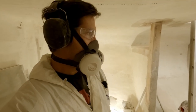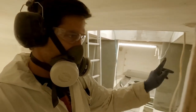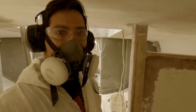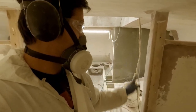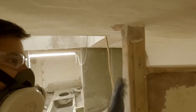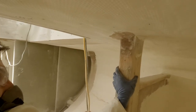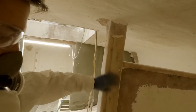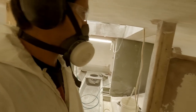But for the keen eye amongst you, you may have noticed that there are random spots where the gel coat has been knocked off. Well, I've been up top fiberglassing those braces, and Dad's been down here in the dust bowl doing a lot of grinding, taking off the gel coat. These are the divider walls in the front hold here. And the fiberglass job on them was inadequate, so he took the gel coat off. I think they just threw a slap of resin on it and then gel coated over it for the most part.